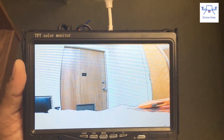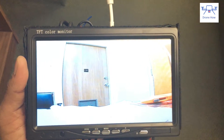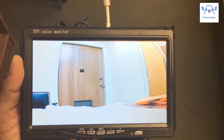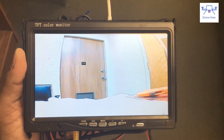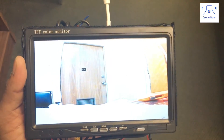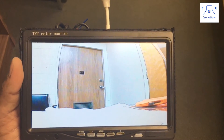The low power level prevents you from stomping all over anybody else's signals, especially if there are other people flying around you — particularly important in quadcopter racing. However, if you have a lot of obstructions, you'll need more than 25 milliwatts, and I'd recommend something like a 250 milliwatt transmitter.